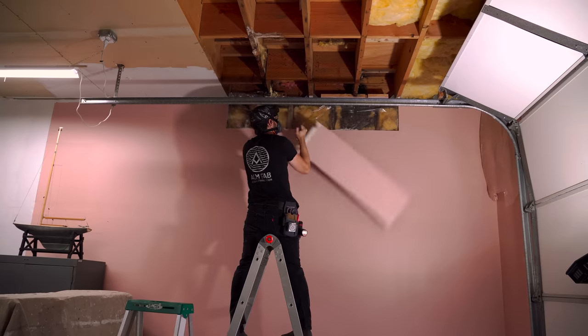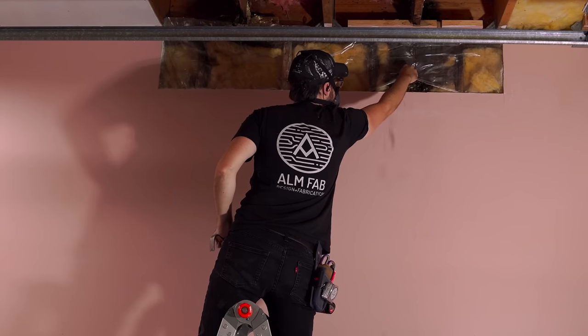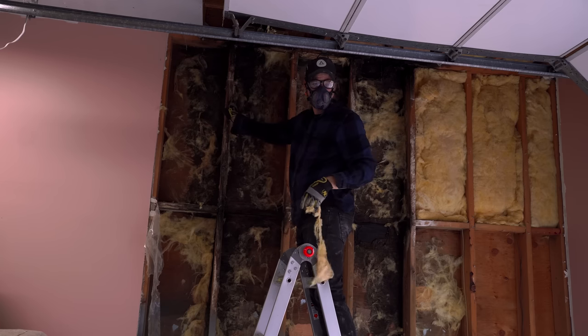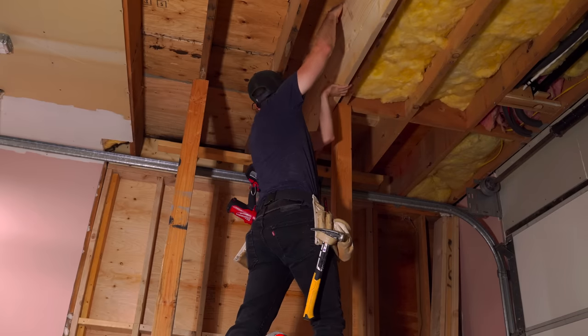No part of this job has been easy. Months ago Ashley and I discovered something really scary — a massive amount of rot inside of the wall below our kitchen door. The wall was legitimately on the verge of collapse. Our staircase was supported by a single bolt in a rotten beam. Since then we have removed the rot, rebuilt the wall, sistered in new joists, and re-sided the facade. But the one thing we didn't actually do is fix that leak.